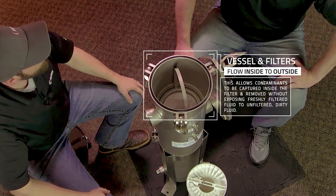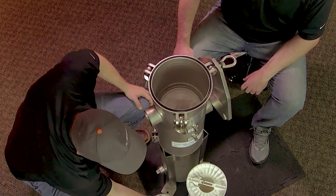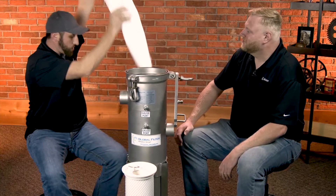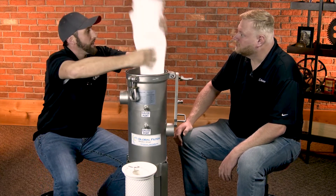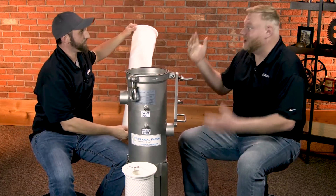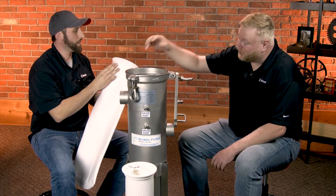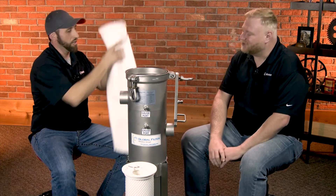After opening, you'll want to drain a little bit of the process fluid or water to lower the level so you can access the filter and grab that bag or cartridge out. There's an extra bag hold-down protection — pull that out, it's simple. These things lock in pretty well with extra protection, so just give it a little pull. Make sure you have a tub ready, drop it in, and grab your new one. The V-seal really locks it in so that particles won't be getting by and there's no contaminant blowby.